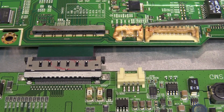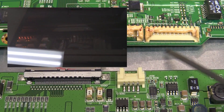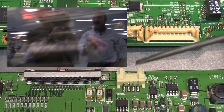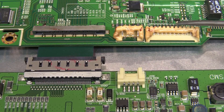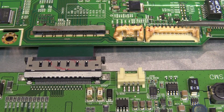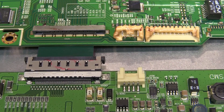When you solder through-hole components, you're only heating the individual pins on the bottom if you hand-solder them, or if you're wave-soldering, there's a big bubbling solder wave under the bottom which goes along and heats up all the individual pins. The individual pins can get just as hot or hotter than the entire connector, but that is the difference. In a reflow oven, the entire connector - including all of the plastics - is slowly brought up to temperature, gets hotter and hotter. If they're not designed to survive it, like these ones clearly aren't, then oops, that's what happens.